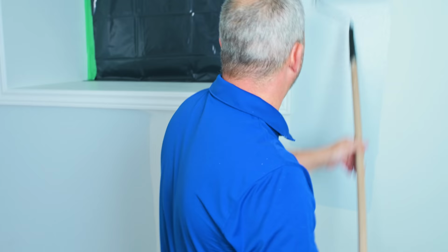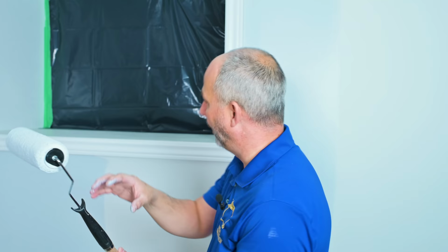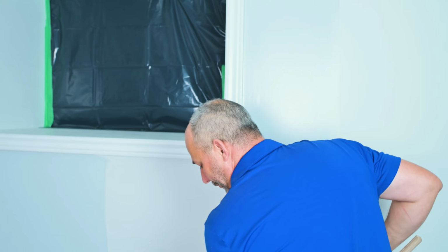Let's just try this. We gotta prime the roller here first. Wow. Okay. So right out of the gate, my first impression. This can probably work for doing like finish coats. Don't buy something like this for drywall primer. You can't put enough pressure on it. I'm already feeling like I'm about to break it. I can't use any pressure. So if you're gonna go with something like this, the roller sleeve seems to be operating fine.